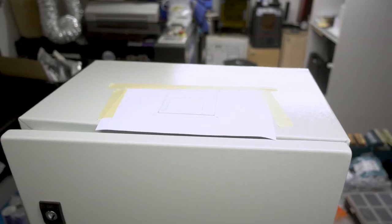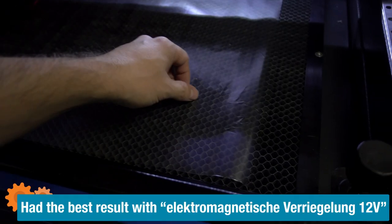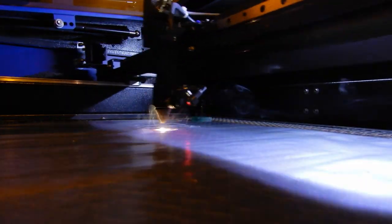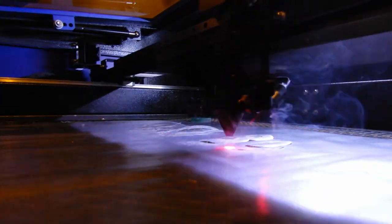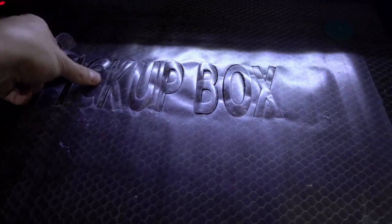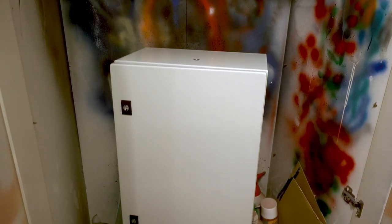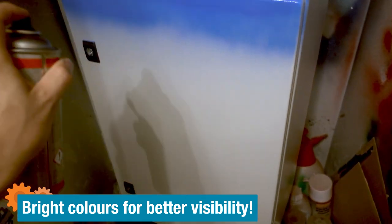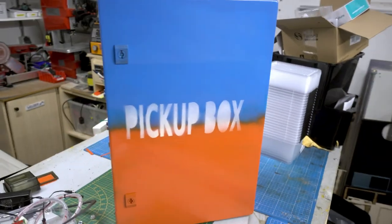The critical part is how do we open and close a latch on the door. There are pre-made parts for this — I searched for a door opening latch solenoid and found one. They're not very expensive, between 10 and 30 euros depending on make and model. All they do is have a solenoid that, when activated, releases the latch. There's also a little microswitch that tells if the door is open or closed: if the latch is inserted it's registered as closed, and you can read that with a microcontroller.